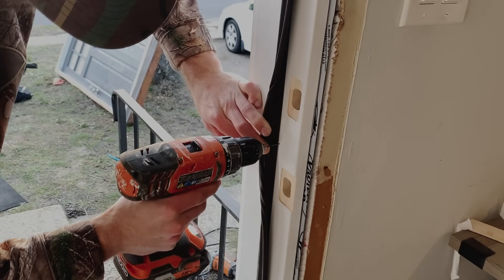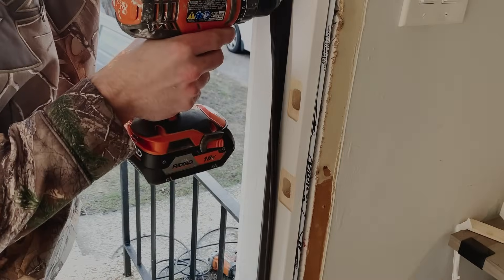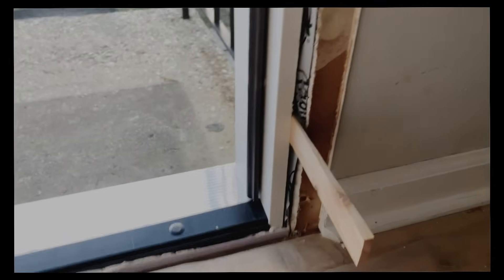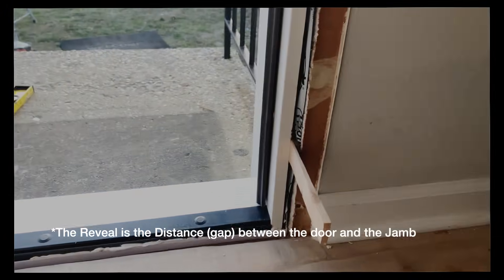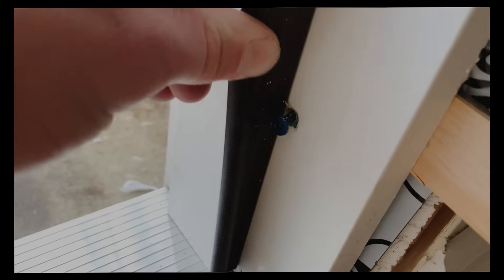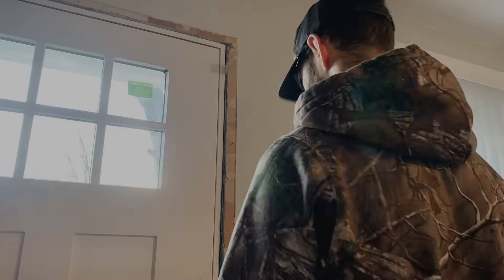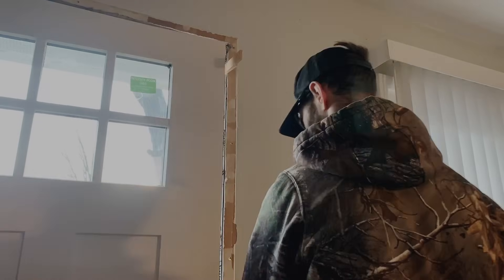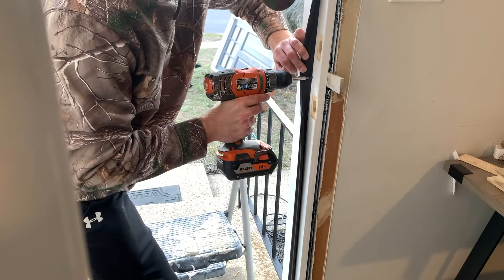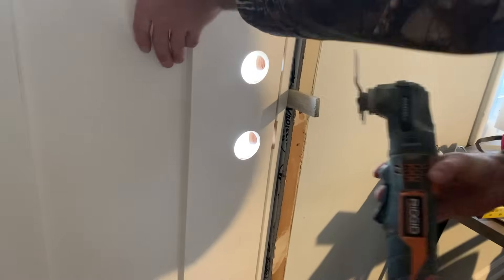With the hinge side of the door locked in place, move over to the lock side. Because we don't have hinges with pre-drilled holes, we need to pre-drill behind the weather stripping on the lock side — this will hide the screws we install later. You'll shim your door until, when you close it, you're happy with the reveal. Once you are, go back, fill the pre-drilled hole, and tighten the screw — but don't tighten it all the way, as it's iterative to achieve the right reveal between the door and the jamb. Here I am moving to the top, making adjustments, then installing shims right behind the deadbolt location. Typically you'll have a screw at the bottom, the top, and two right above and below the deadbolt. Once I was happy with everything, I re-tightened the screws, fully tightening the lock side.